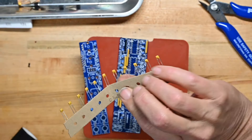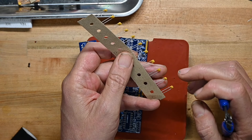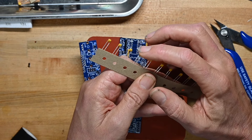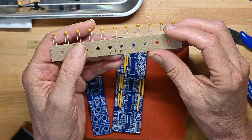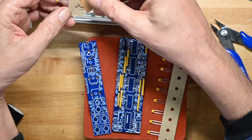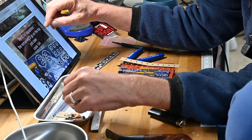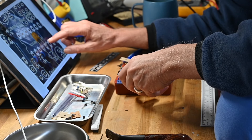Now we're doing the tenth-of-a-microfarad, 100 nanofarad 104 caps. There should be 12 here but he says 10 go on this board and the remaining two go on the top PCB later. I'm counting 11. I'm also seeing two 0.47s and two nanos. I may be missing one cap, but fortunately I've got spare 104s. Let me count on the board to verify. He may just have been behind in updating the guide, since I'm only seeing one tenth-of-a-micro position and the design appears revised.